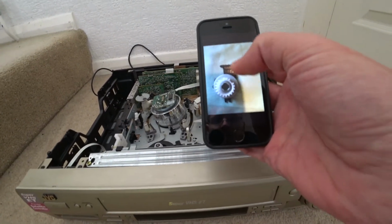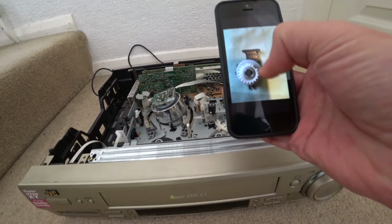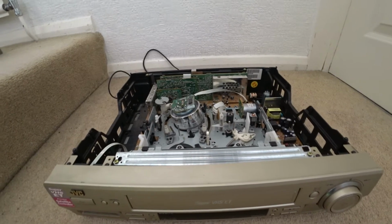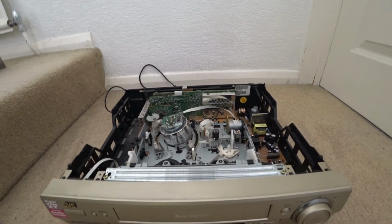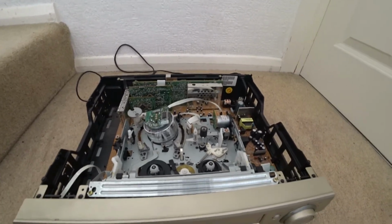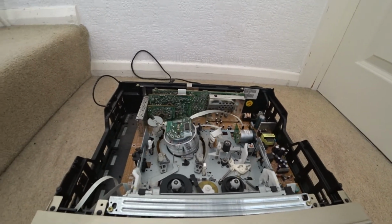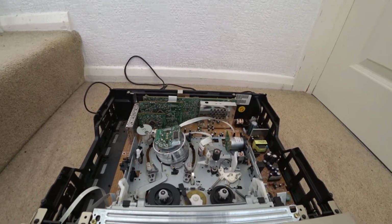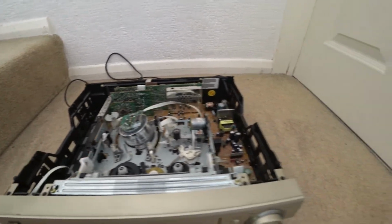So I took a picture of it as I took it off the machine, because you've obviously got to line everything up, because internally there's a piece of metal which sits on some contacts, and those contacts can vary, so it can tell the machine what mode it's in. So I popped it out. I was able to take it apart, but unfortunately it appeared that the actual metal contact, which is sprung, had come away from the plastic. So I thought, okay, this really looks bad.